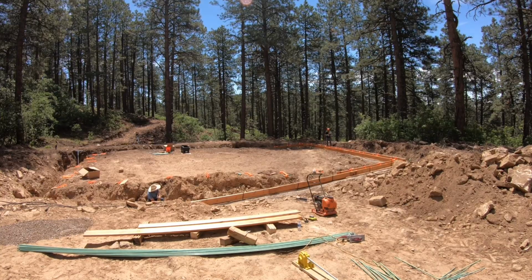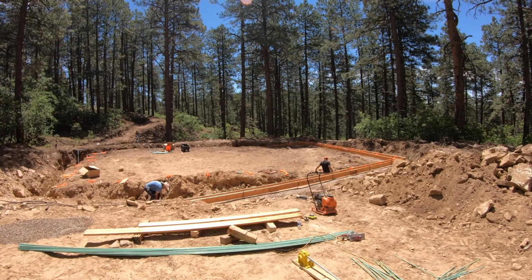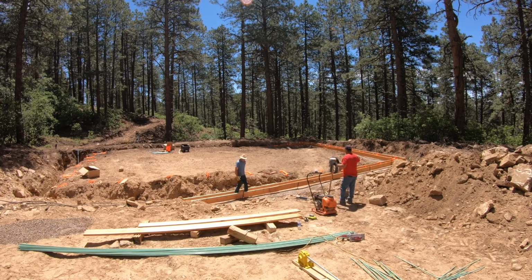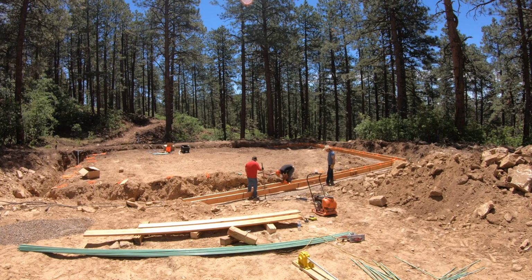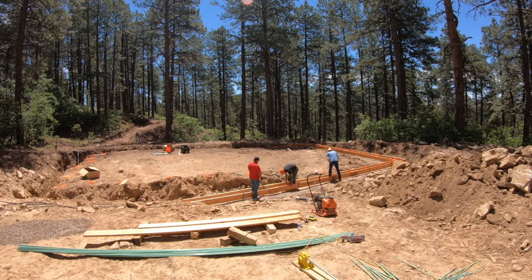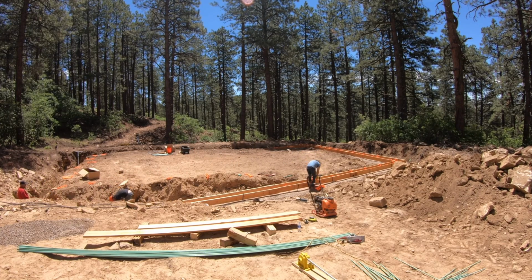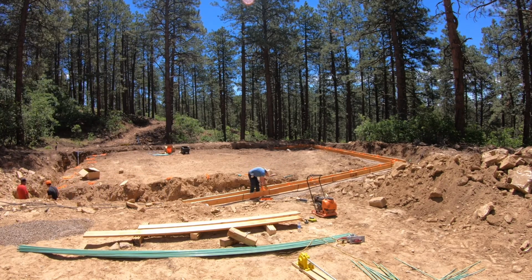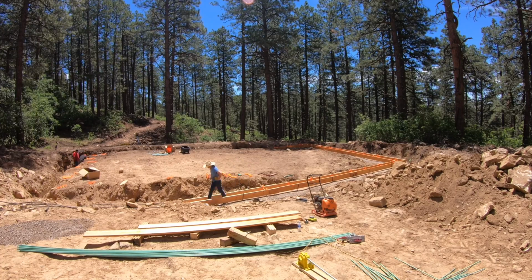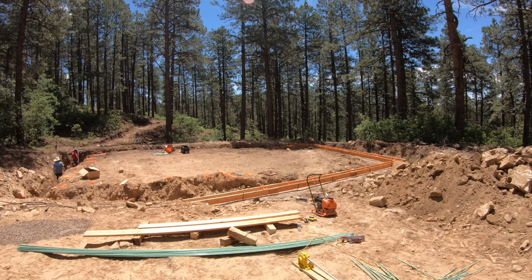I don't know. They didn't show up till, what, 8:30? So 9:30, 10:30, 11:30, 12:30. It probably took us 6 hours for 3 guys to set all these forms and install all the rebar. And that's not bad. Although before I pour, I do need to go around and block some of the high spots to keep the concrete from leaking out the bottom. But it really looked good.